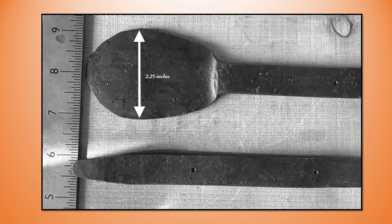When I spread I get about 75% of my expected yield. In theory, if this is three-quarter inch wide and a quarter inch thick and I'm spreading it out to one-sixteenth — because there are four one-sixteenths in a quarter inch — I should get four times three-quarters of an inch, so three inches. I don't. I get 75% of that, or about two and a quarter inches. The remainder seems to go into stretch of the bar, elongation, and scale.